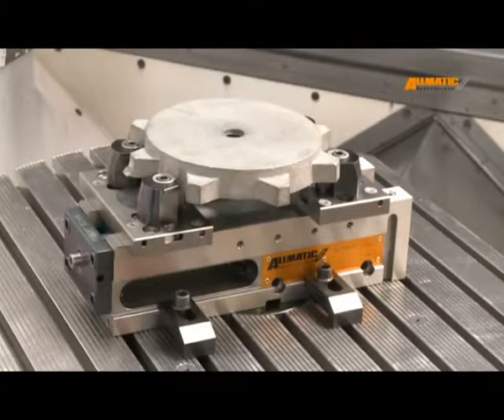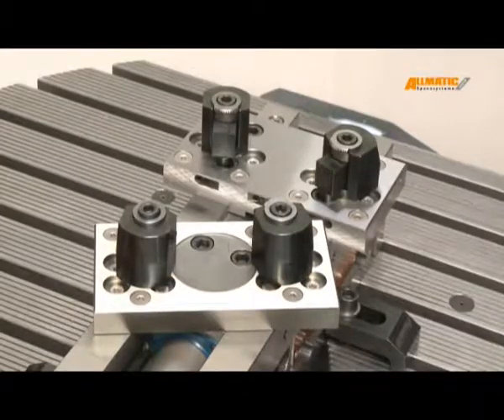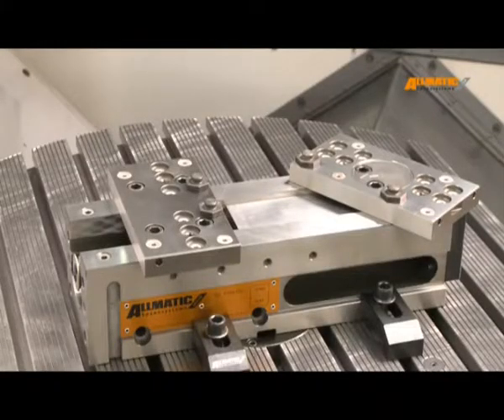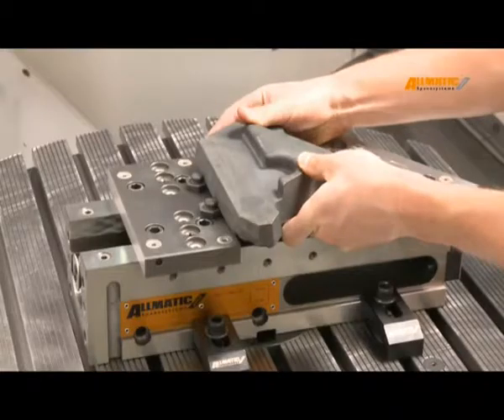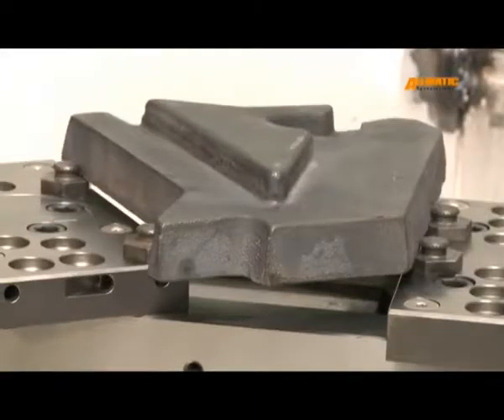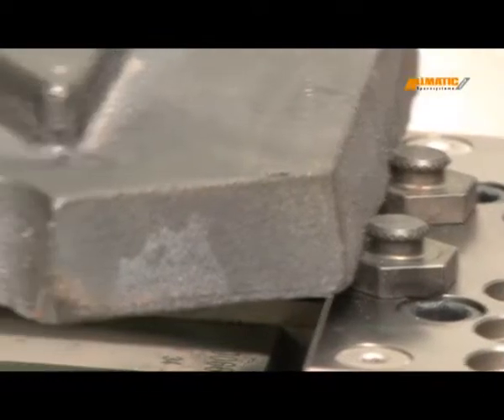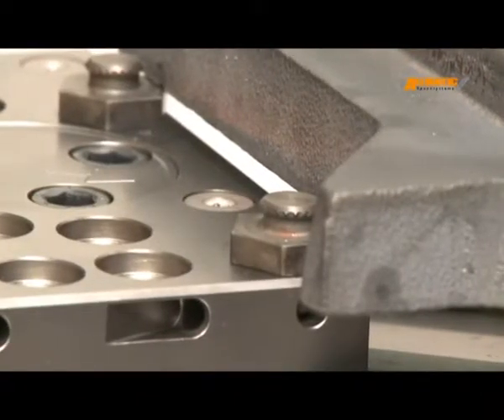By the diverse applications of our Titan TC, you can clamp with the movable support jaw and our gripper, unlimitedly flexible. The gripper can be screwed variably on the whole matrix based on the support jaw. The additional pendulum function of the mobile support jaw is used to compensate non-parallel workpieces, so you have the opportunity to clamp various geometries.